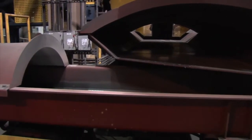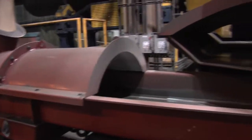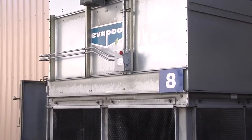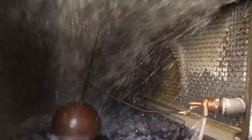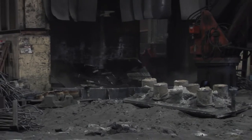After the sand passes through the final screen, it goes through a five stage fluidized sand cooling process, at which the sand is cooled between 90 and 60 degrees. We cool the sand with a 50 ton evaporative water cooling tower, and during the summer we up the cooling capacity by adding on a 60 ton water chilling unit. These units have their water piped through the sand cooling beds and then recycled back to them to be cooled or chilled again.